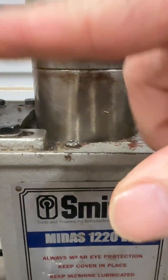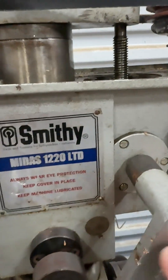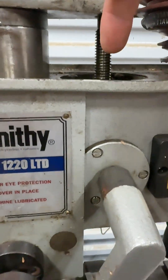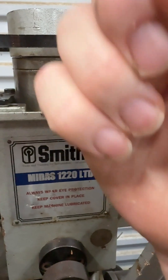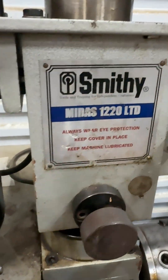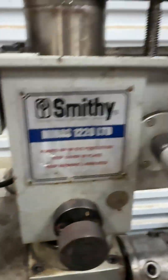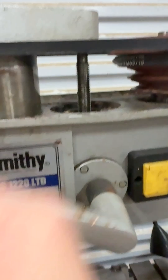You can see it pulling down. If this belt wasn't in the way, you can actually see this flexing where this whole thing kind of cants like that. Good question though — very good question, because this thing is kind of counter-intuitive. All of the force on this lead screw is pulling down. The only time there would be any force pushing up is if you're cranking it down and it doesn't slide down that tube, but usually the weight of the mill head will pull it down anyway.